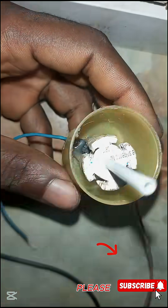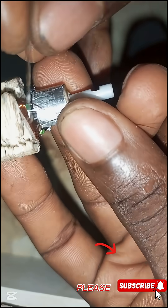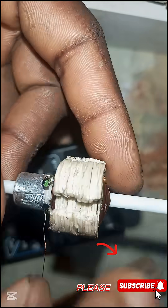It's time for the armature winding. In this experiment, a 38-gauge wire is being used. Start winding by connecting the wire to a commutator segment and through the slot opposite to it, taking slot one. Jump slot two and wind through slot three. For simplicity, we used 50 turns each, but more can be done for a greater result. Connect the coil end to the second commutator segment.